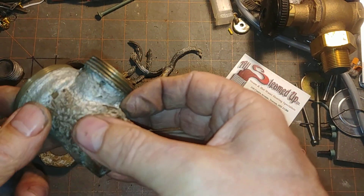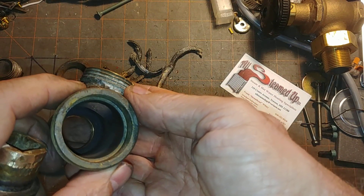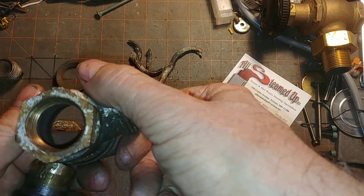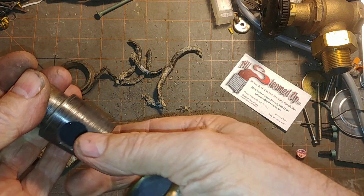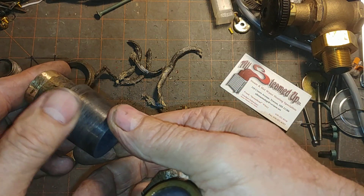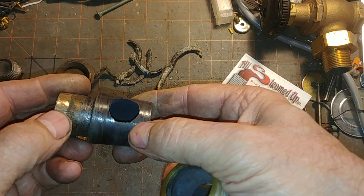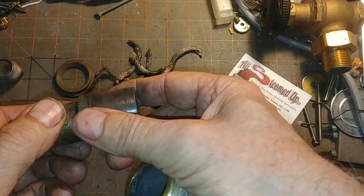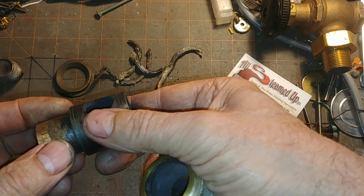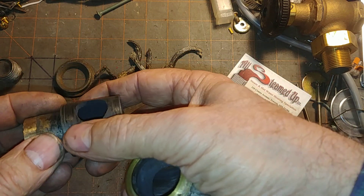Here's the shell. You can see the parting line from the original casting. It's a tapered, machined surface there. This is the internal plug, also tapered. I think there's a graphite material on the inside — relatively slippery. I would probably gently clean that off. Any rough spots, hit it with a very fine 300-grit emery cloth or even finer crocus cloth. You want that fairly smooth.